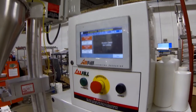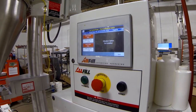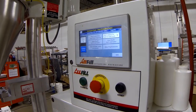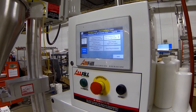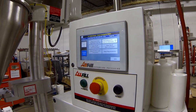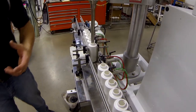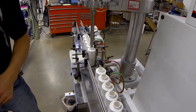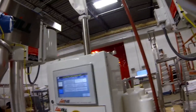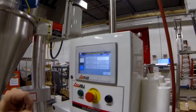Vibration option is not installed but it can be installed — the software is in there and we can enable that feature, we just need to mount the vibrator. We typically put the vibration actually inside the conveyor channel, mounted inside here; we cut out a little square and vibrate right through the chain. It would be an electric vibrator.